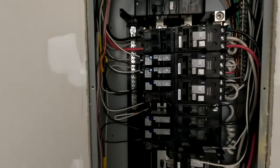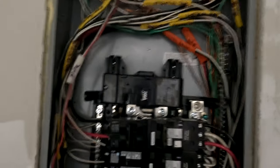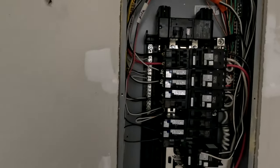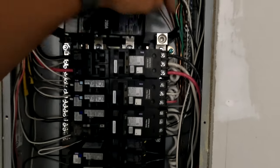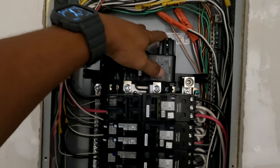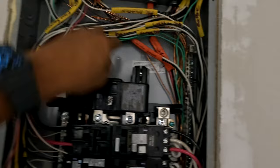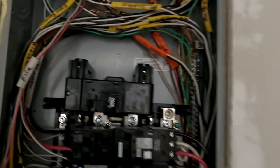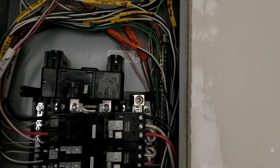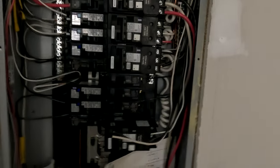This is the next day. The electrical panel is pretty much wired minus a few breakers that I'm short. It looks a little messier than I wanted, but I think it's going to be functional. I wired it as a secondary panel as I mentioned. I still need the main power coming in — it's obviously not a live panel — and I still need to ground it. I'm going to have to cut into this up here to get power running in.